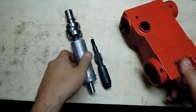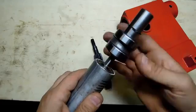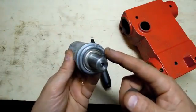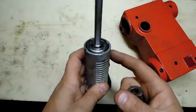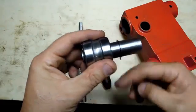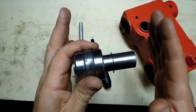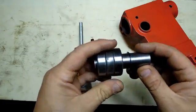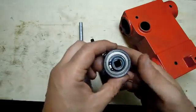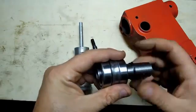And the big surprise for me is a grand total of 4 bearings in the spindle. So we've got 2 at the power side, and then we've got 2 in the quill. The quill is aluminum. These bearings don't feel too bad. I'm going to replace all 4. I can feel them sort of breathe out of parallel, let's say, as I rotate this. So either it was a hasty press fit, or, I doubt, a little shaft this small is bent.